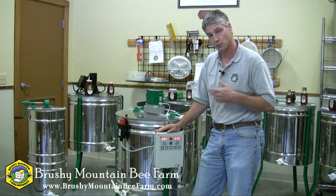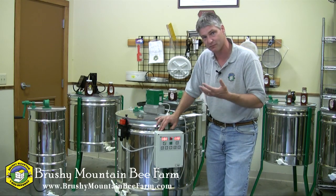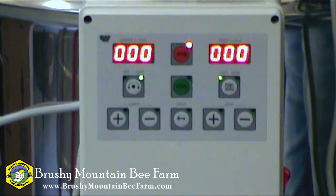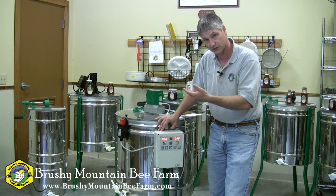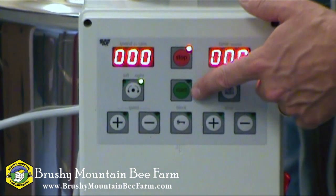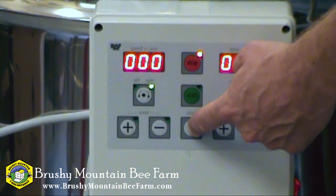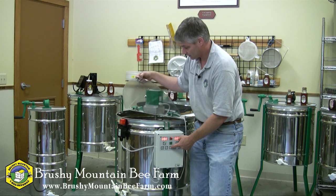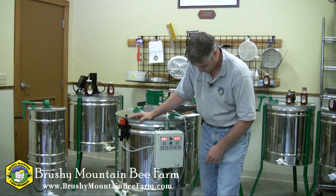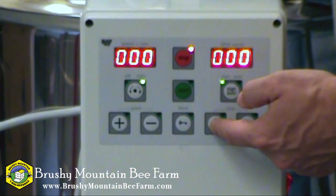There are three programs that you have on this as well as a manual mode. This readout here shows your speed as a percentage of maximum speed — it's not spinning right now so it's at zero. This shows the time in seconds that the extractor is cycling on, so you can set it to turn to the left for 60 seconds and then turn to the right for 60 seconds. Down here are the adjustment controls: the stop and start button, and this button is how you unlock the plastic cover — push and hold it for five seconds, you hear the click and now it will open up. If you close it back down again, it's locked, and the extractor won't operate unless that lid is closed. This is how you change direction left or right, this is how you change your speed increase or decrease, and this is how you increase or decrease your time.